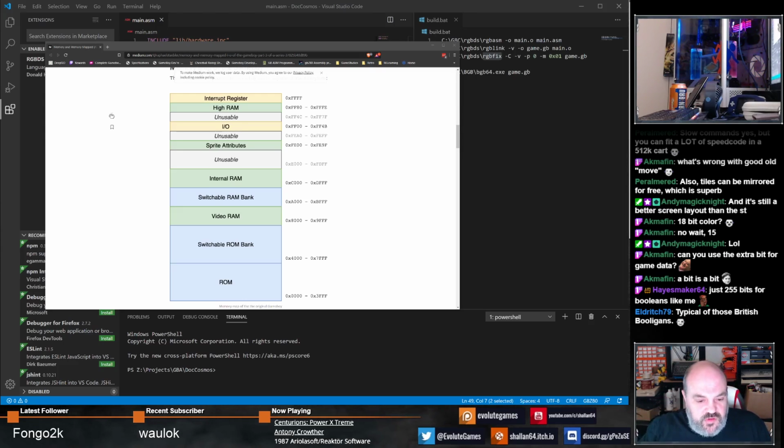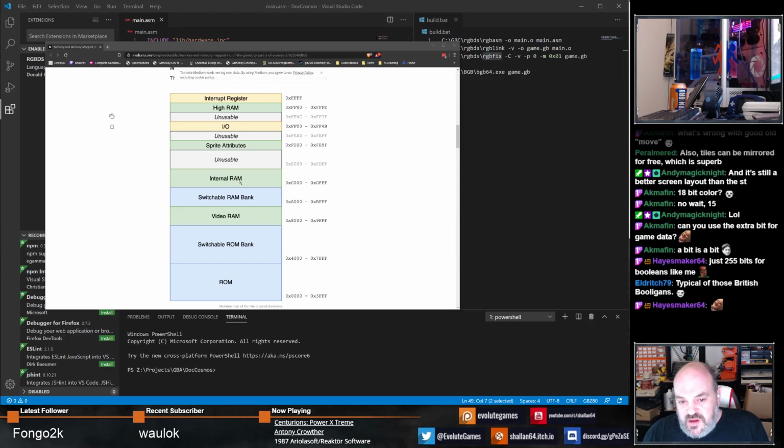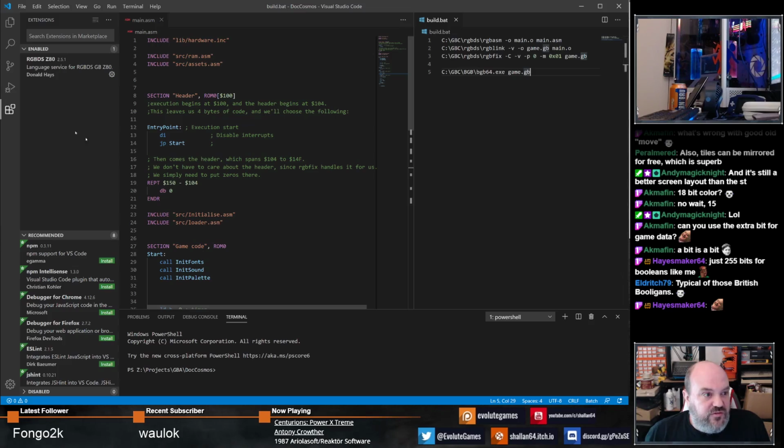So that was my first pitfall, is I was trying to store variables in the middle of my code. And they weren't being written because they were in ROM, so whatever I wrote there would just get ignored. In fact, it wasn't being ignored, it was doing something completely different, which I'll explain in a minute. And so what you have to do is use this internal RAM here, which is at C000, to do these things. And so for that, I do have...